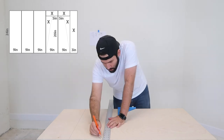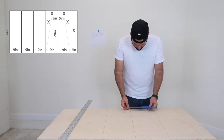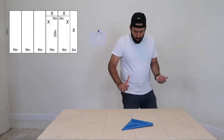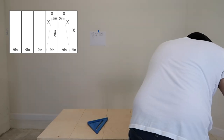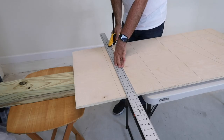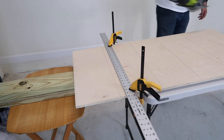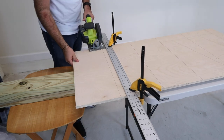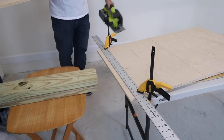I first started drawing my lines out onto the board to start making my cuts. You're going to get two little extra pieces in the triangles and a 3 inch piece at the end that I'll probably use for some other projects. You do want to draw the two tops back to back and cut them back to back, just in case if you miss any of the cuts they'll actually match up with each other. Make sure you always clamp down your board. Since I don't have a rail, I made my own — I clamp down my straight edge and cut right along with it, and I repeat this for every single cut.